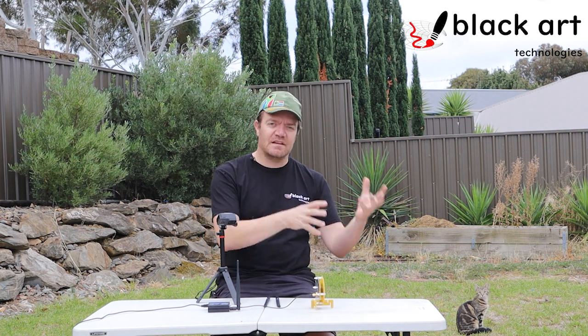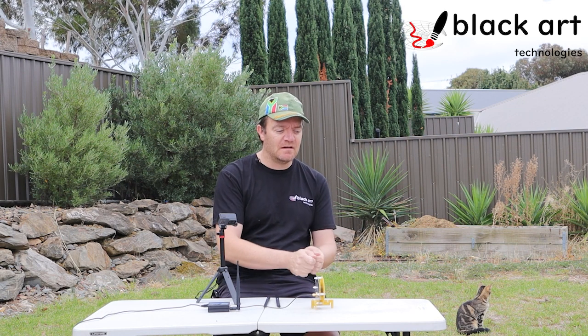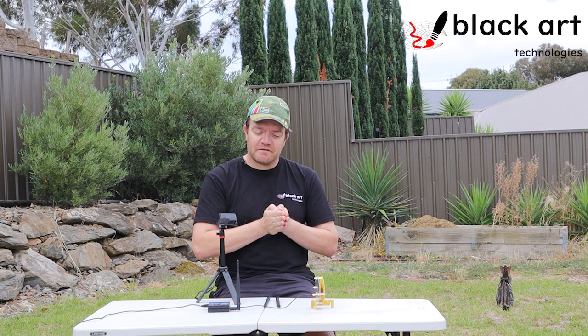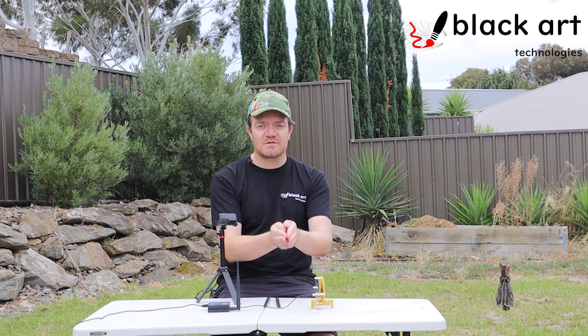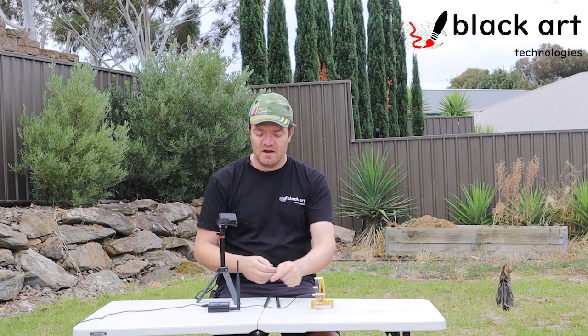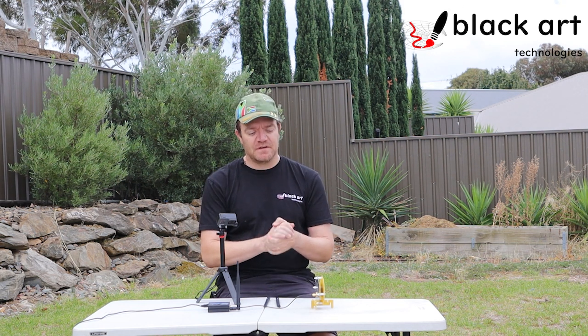Specifically, it's not a good idea to split through a device that is not a properly designed splitter. Splitters do have their place in systems where you need to route a signal to two different places, but it's like a flowing river — you have flowing power coming through the antenna. If you split it to two places, you literally split what's available into two.